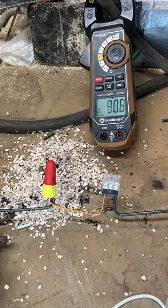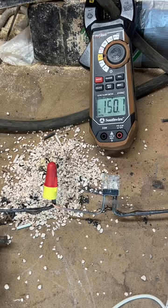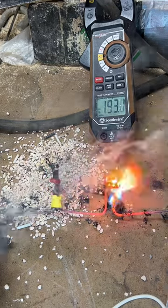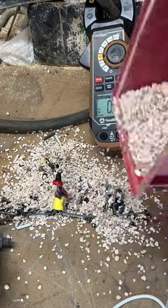We had a fire extinguisher standing by along with oil absorbent to put out any fires we created. Next up, a 3M wire nut versus a six-hole WAGO. They survived 100 amps for five minutes and 150 for three minutes, but we finally had the failure at close to 200 amps on the right.